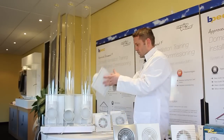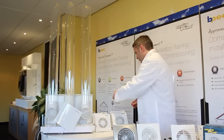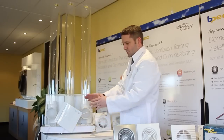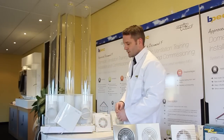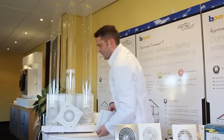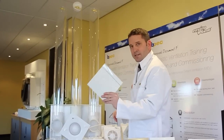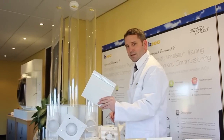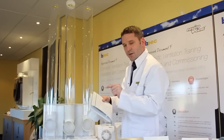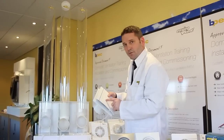I'll take this one with the flat front cover first. I plug it in and you can see it's come on. If this fan's doing its job properly, it should be pushing the disc up inside the tube — which it's not doing. But if I take the flat front cover off, the disc flies up, and that's because flat front covers are the enemy of axial fans. They look nice, but they impede the performance. So it's just worth bearing in mind: if you choose an axial fan with a flat front cover, the likelihood is once it's installed it isn't going to perform properly.